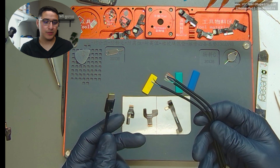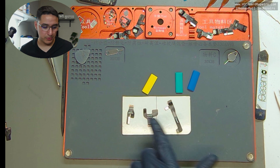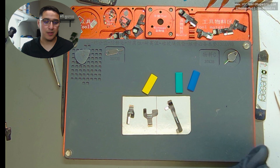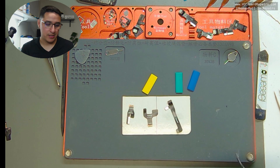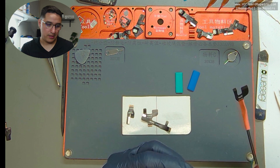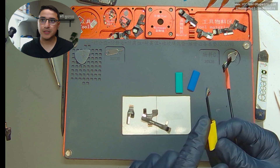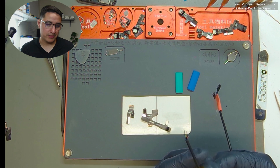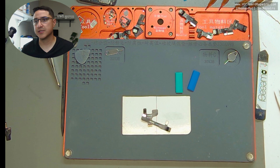So this is basically what you get: a cable with three ends, one for each connector, multiple connectors, and heat shrinks. Let me show you a cable that is almost complete. You have two connectors and the heat shrinks. In this case we're gonna do a heat shrink over this cable — make sure you do this first before you solder because you cannot get the heat shrink over the connector after you've soldered it on. Then grab your connector and let's go under the microscope.